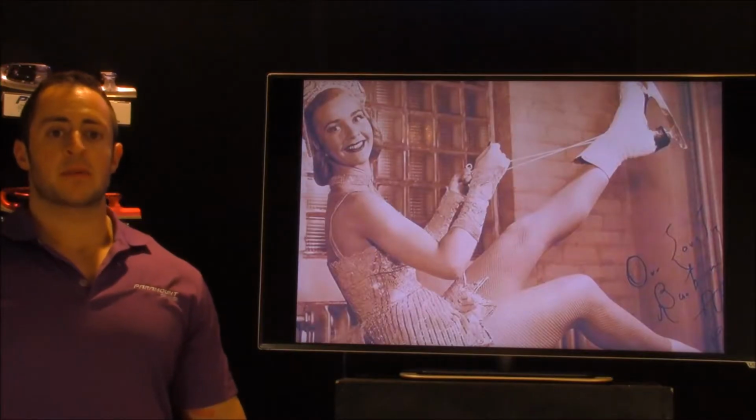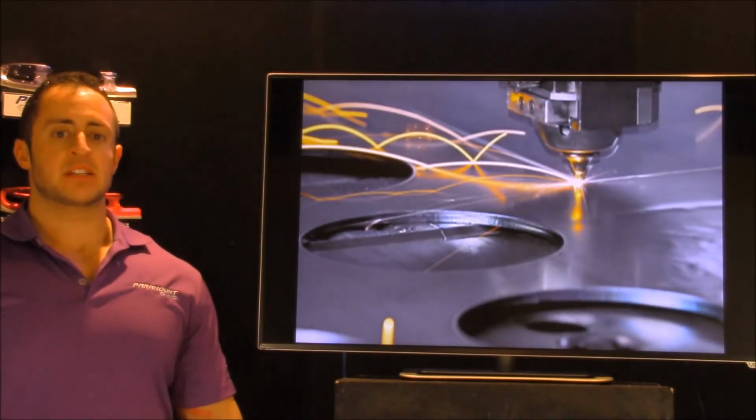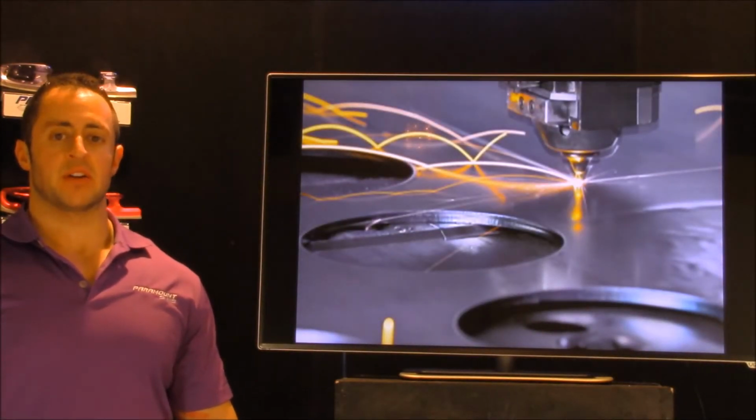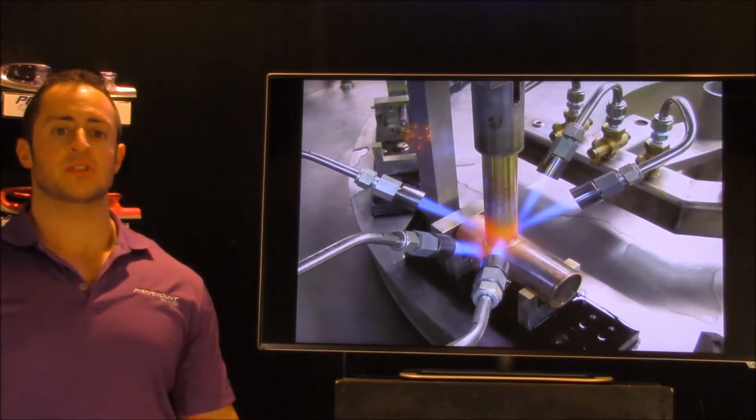increase a skater's performance. The most common blades were developed in the 1930s and are still used today. Here we show how they are made. Plates cut out of steel and simply welded together. In order to keep the metal from warping, brazing and low temperature silver solder is used.